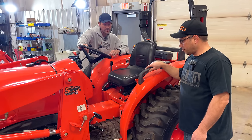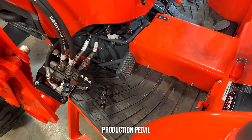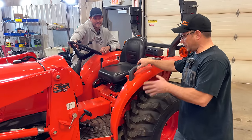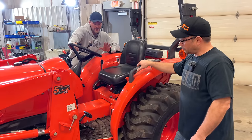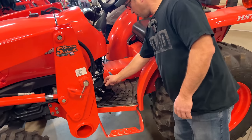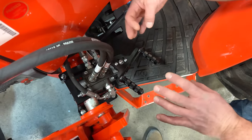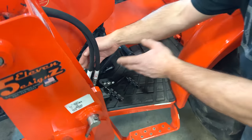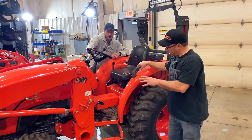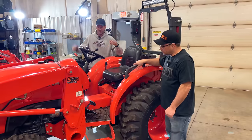That's pretty sweet. Now that's a different pedal design than the prototype, isn't it? And that's part of the reason this has taken six months or more from our initial video. I've gone through three or four different pedal designs until I settled on this - it's the most comfortable to operate. It's adjustable - you can move the pedal itself and the valve to a couple different positions. You can also move the entire valve on the loader tube, rotate it, as well as move the valve on the mount system forward or backward.